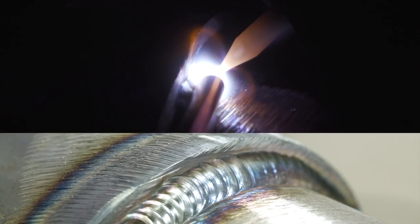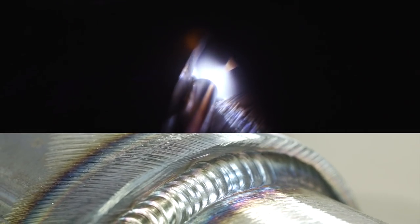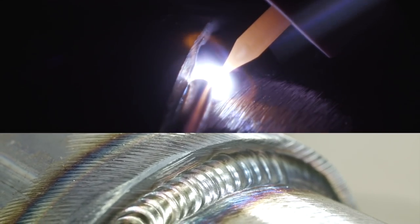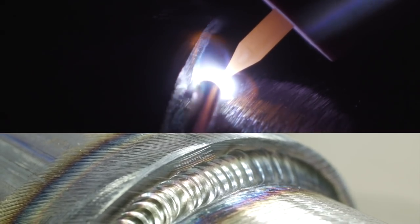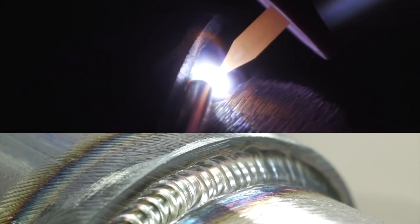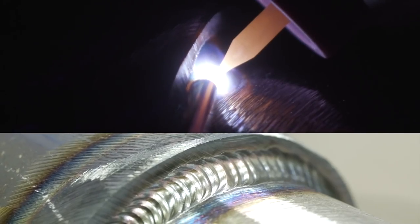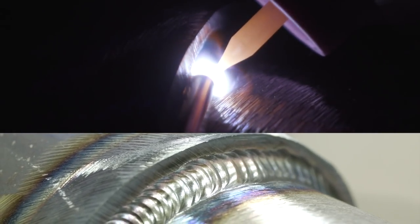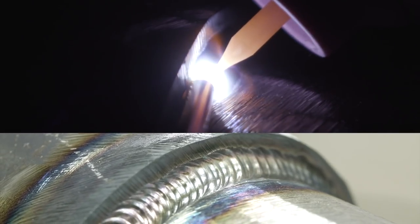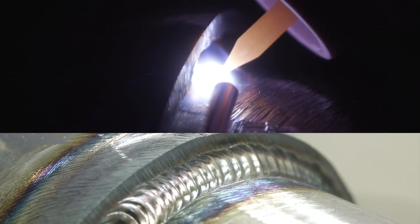I'm resting my arm on the pipe — or you could have it off the pipe. We're going to initiate the arc and get it to the size that you want. I usually get it a little bit big, but it's not busting over to the top edge of the pipe — I want to keep it inside the little groove there, the fillet. I count and keep my dabs consecutive: 1001, 1002, 1001, 1002. It keeps your rhythm going and keeps all your dabs nice and even.